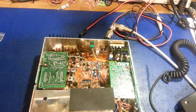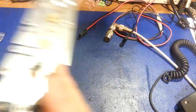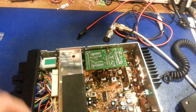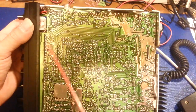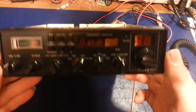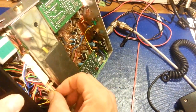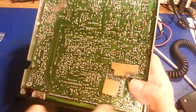There are a few tips on connectors and interconnects. A lot of these plugs and main header sockets on these type radios — on the top side of the board for the frequency counter module — make sure those are checked. If mobile radios have been in use for any length of time, it's very common for these solder connections to break out. When the radio's mounted in a vehicle, all the components are hanging down — you have the weight of the wiring harness, and every time you hit a bump, that wiring harness is bouncing and trying to rip itself out of the circuit board, which puts a lot of stress on solder connections.